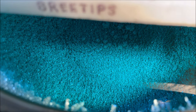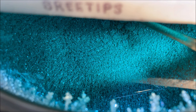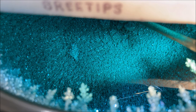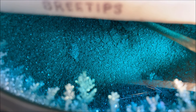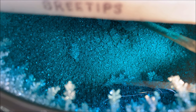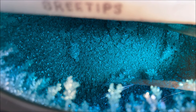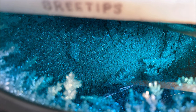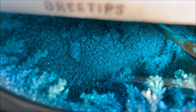What we do is put impure silver granules in an anode filter basket that sits on top of the silver cell. We pass an electric current through the impure silver — the current dissolves the silver, and the silver ions travel through the electrolyte and plate out on the inside of that stainless steel bowl as absolutely pure elemental silver metal.